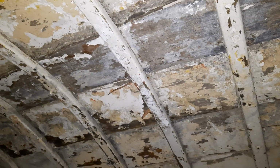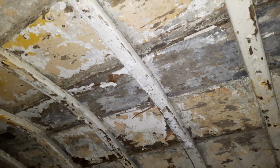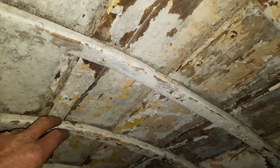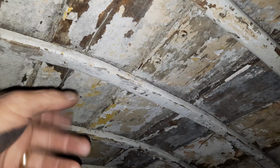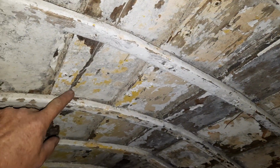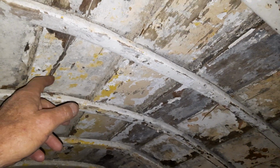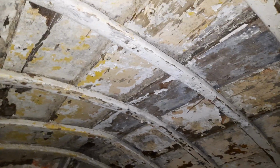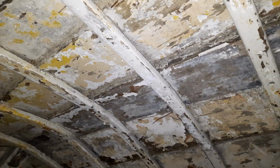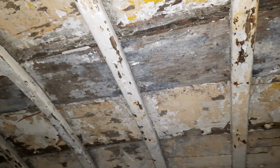Anyway, what I have to do now is I'm going to clean this up enough. So I'm going to mask over that so that I can pour resin in it and it won't just flow out. And I don't want to waste it. I could just clean it, paint it with the resin and then make a putty that's dry enough to not run through.